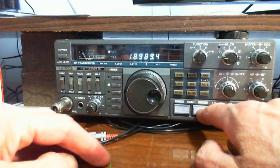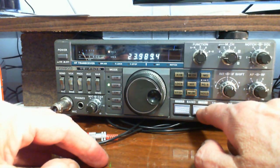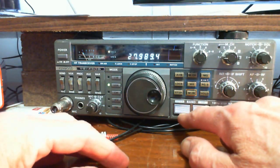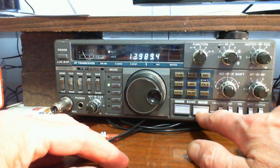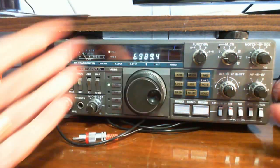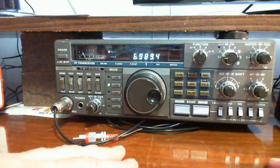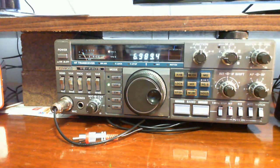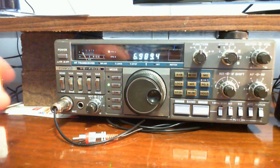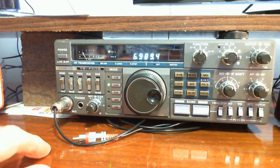It could be quiet up here because of poor antenna conditions, but I suspect this is also a relay problem. That's the basic demonstration of the relay problem — of course it's just dirty contacts. And why does this radio have so many relay problems? Because this radio has a dozen little relays in it. What are the chances you're not going to have trouble with a dozen relays? Pretty low, because relays are unreliable devices.